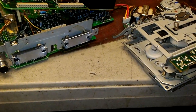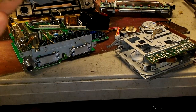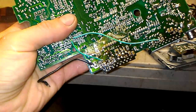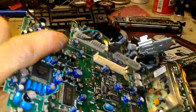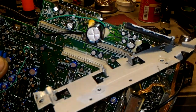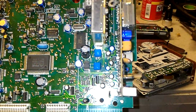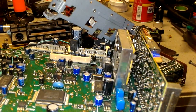Now the chip itself, I happen to have a radio that I took the chip out of, but it took me quite some time to remove it, because I had to torch the board, because this radio came from a flooded vehicle, and obviously the chips are not affected, but if you look at the areas, there is some green stuff that is a clear indication of moisture. But anyway, it doesn't matter, because chips are sealed, so we can still reuse the chips, and this is one of them that I replaced right there.